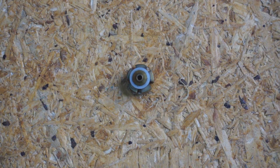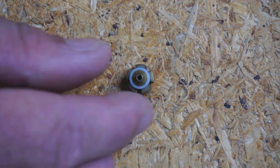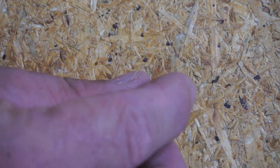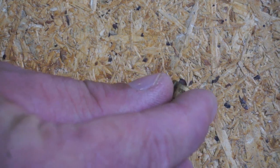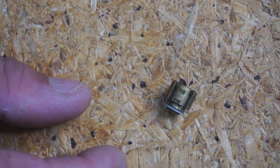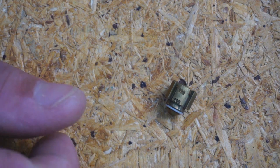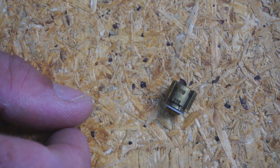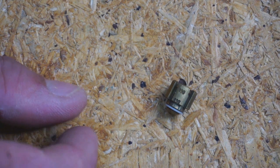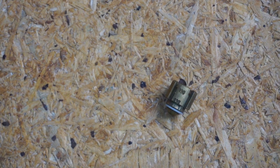We're looking at a standard Danfoss-style piston that you might see in a Lennox unit, a Goodman unit, and a few others. There are little grooves down the side and you'll see numerical information on it — this one reads 68. Typically in residential I'll see pistons anywhere from around 49 or 50 on the smaller side, all the way up to almost a hundred for the largest ones on a 5-ton evaporator coil. This one at 68 is right in the middle, probably two to two-and-a-half tons.